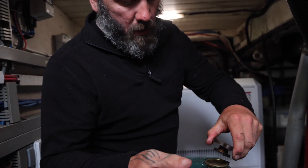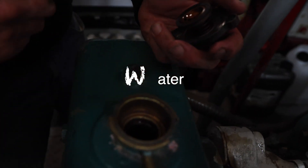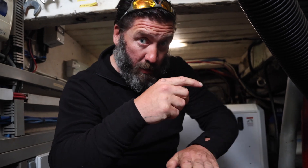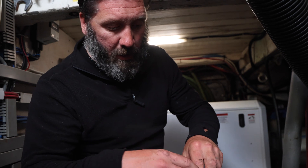Here I'm checking the coolant and the coolant level — this is part of the water check. We turn the sea strainers off and check them, and we check that the coolant levels are right. Then once we start the engine, we make sure water is running out of our exhaust, which means the loop is getting cooled around the engine with the raw water.